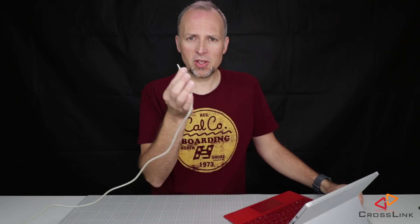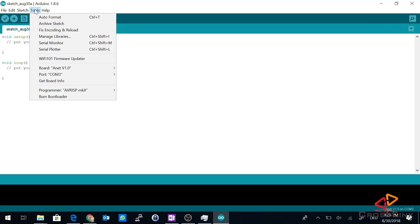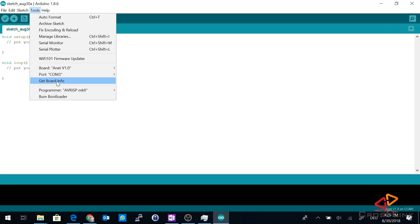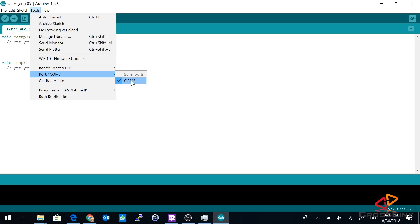Step four is to connect your printer to your computer using the USB cable. Plug in the USB cable and make sure the printer is turned on. At that moment your computer will install a so-called COM port. In my case it's called COM3 — it could be a different port in your case. Go to the Arduino IDE, open the Tools menu, and you will see the port appearing in the port submenu. We're going to select COM3 as our port to upload the firmware to.